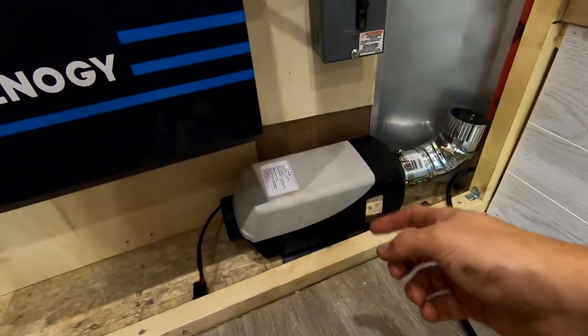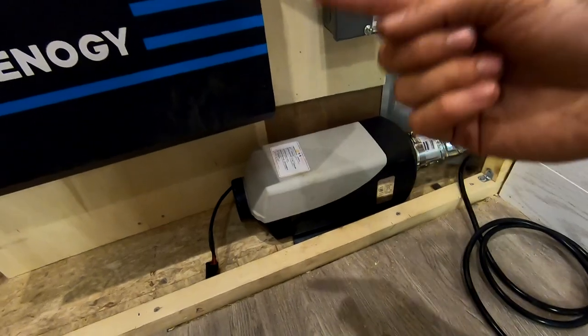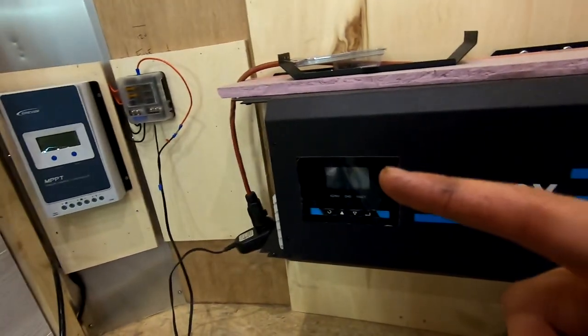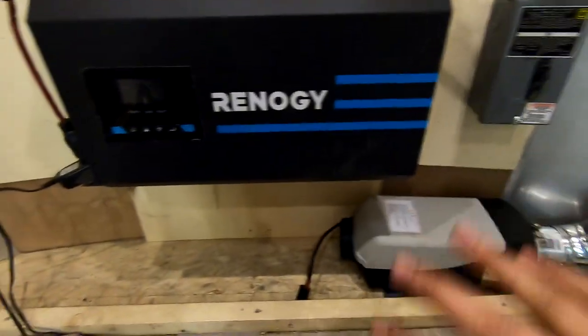Okay, the next steps are gonna be to mount the fuel tank, the filter, and the pump. I'll have to run the wires up inside and connect to the harness. While I'm doing that, run the wires to the power source, my fuse block, and for that, I need to have my wiring done. So it's just kind of all happening in tandem right now.